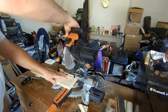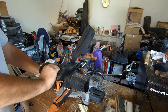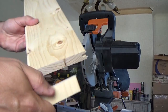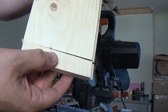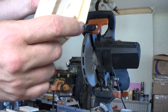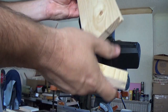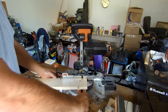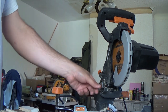Only a little bit, that's okay. And let's do a cut on our soft pine floorboard again and see how clean this cut is. There we go — that is very good. There's no tearout on the top, none on the bottom of that one either, although we had a bit on our trim. Just a little bit of tearout at the back.